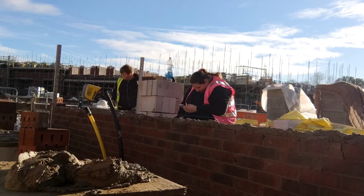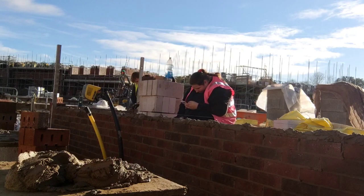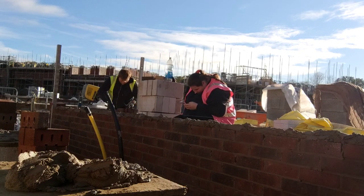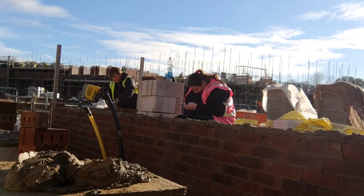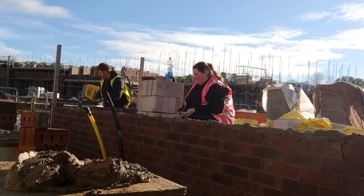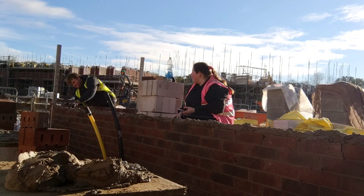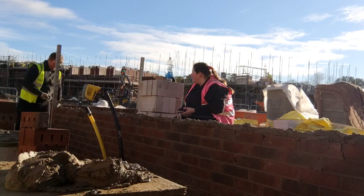What I should have done is, once I'd completed a course, worked my way back to the other end of the wall — move the line up at the furthest brick from the camera, then work my way back spreading, moving the lines up as I reach the end of my spread. Normally my missus moves the far line up and I move the profile line. I try not to let anyone else move the profile lines because the corner one can move.